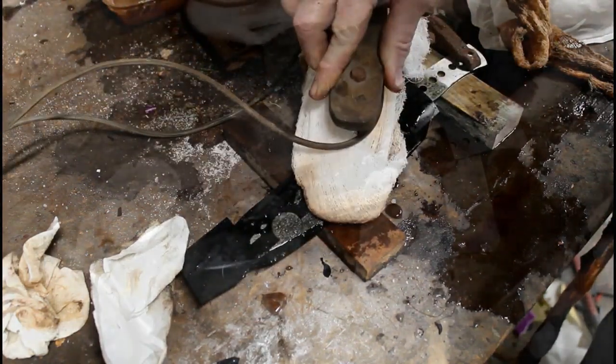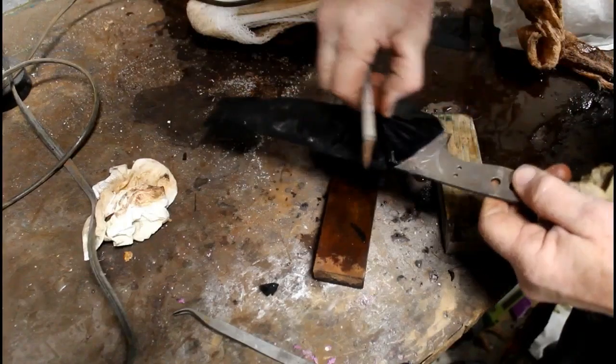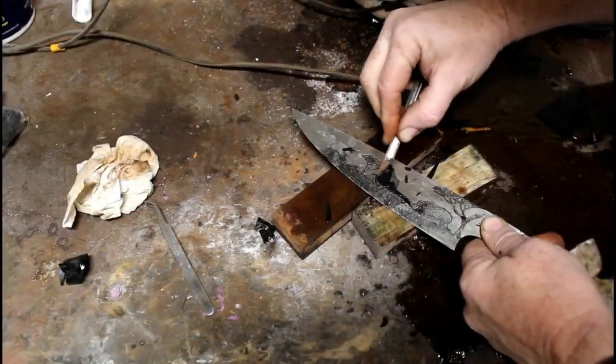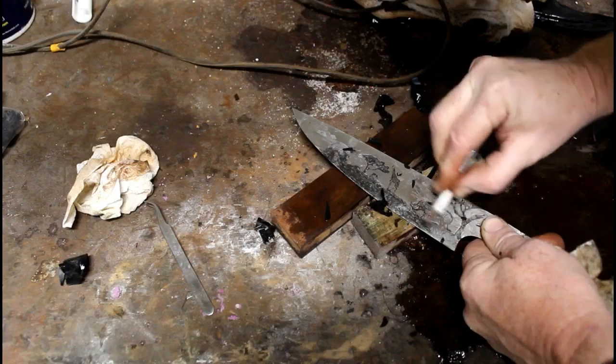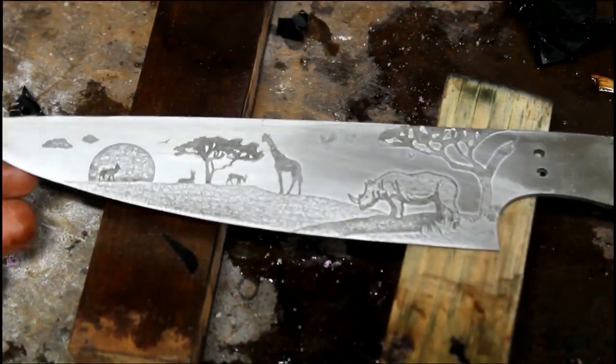When my customer contacted me about doing this, I really had to give it some thought. I came up with the design for the blade pretty easily, but I was kind of struggling with what to do for the handles. We'll finish up the blade etching first — I'm just pulling off all the vinyl. After all of the etching is complete, I remove all the vinyl, clean it with a little soap and water, and then rub it down with 400 or 600 grit paper. That's the first time you're really going to be able to see if the process worked or not, and this one I was actually quite happy with.